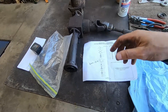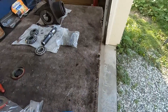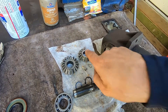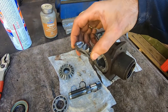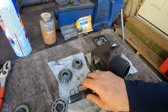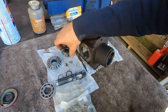What happened was the operator hit something hard — a rock we think — and it came to such an abrupt stop that it fractured two teeth off of this gear right here inside the gearbox. The operator shut off immediately, which is super smart, because it did only minimal other damage to the expensive shafts.